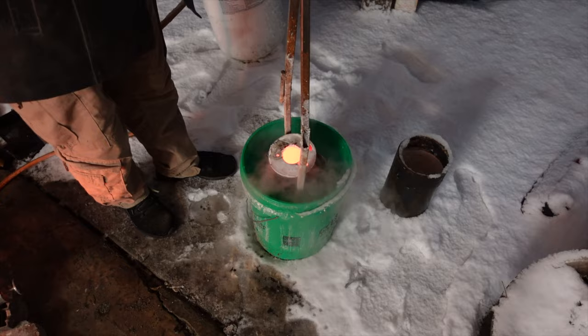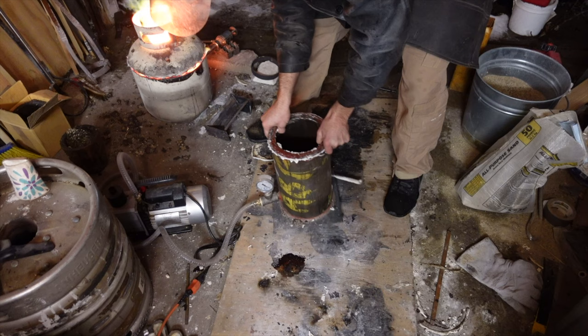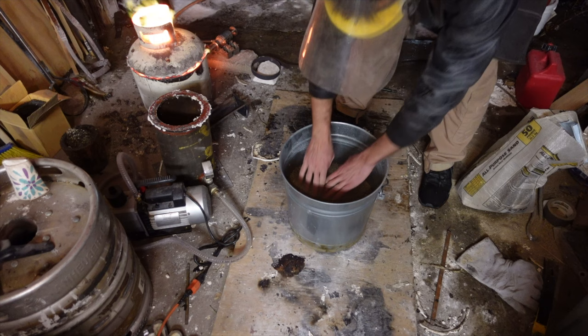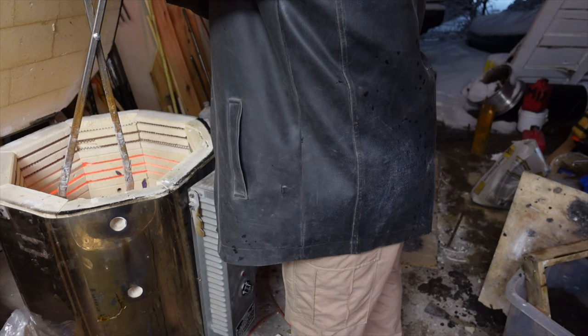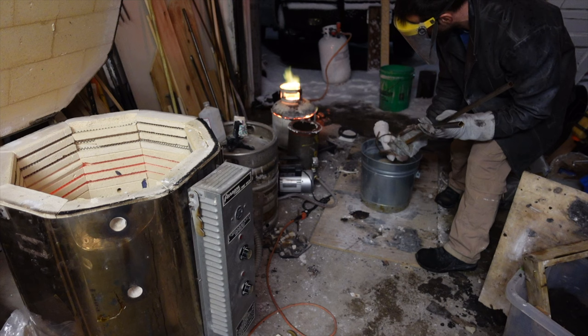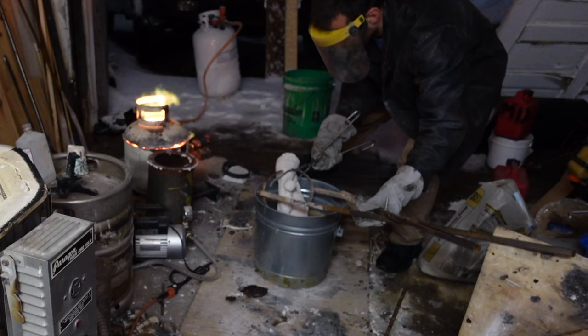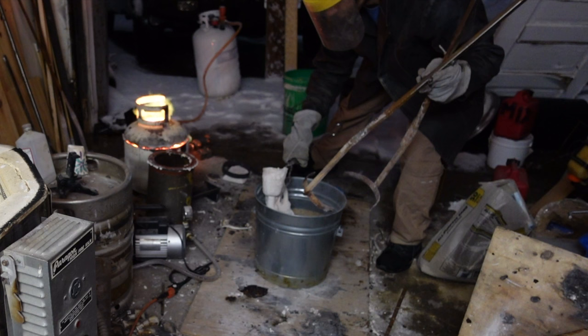The investment breaks up and dissolves away when it's quenched, unlike ceramic shell. Then it's time for the vacuum casting setup — bring in a bucket of sand. I've heard you don't really want to bury your ceramic shell in sand halfway; if you do, it has to be completely buried, otherwise it cools at different rates which can cause problems. So in this case, I'm just using the bucket of sand as a safety measure — if the shell breaks, the metal will run into the bucket of sand instead of all over the floor of my garage.